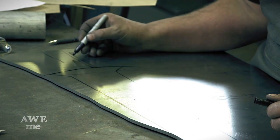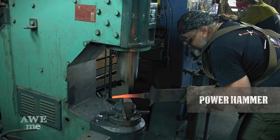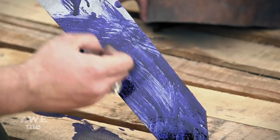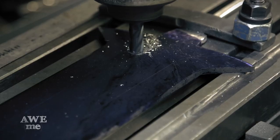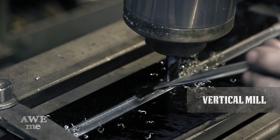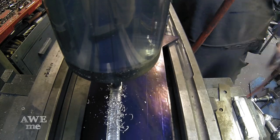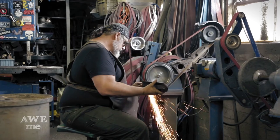The tang of the profile cutout was left a little bit wide so I could forge it out to a 3/8-16 thread. We took the blade over to the vertical mill to remove about an 80-thousandths thick layer down the center of the blade — somewhat of a flat fuller — leaving about one inch on the edges to be used for the edge bevels.